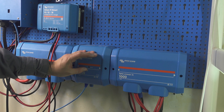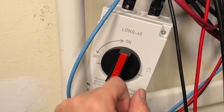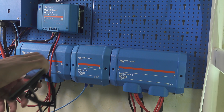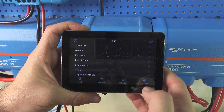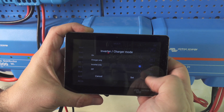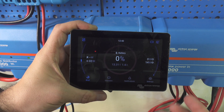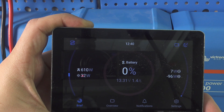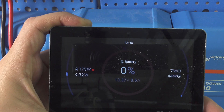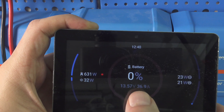We are ready to re-energize the whole system. We are ready to re-energize the solar panels. As you can see we've got the power indicator, so we haven't blown anything. Let's take a look at our Cerbo GX device list — the Multi Plus state, we've got the mode set to charger only. Let's take a look at what kind of reading we are going to be getting. I can see the AC grid side comes up and we've got a positive reading.